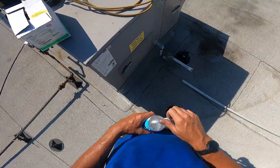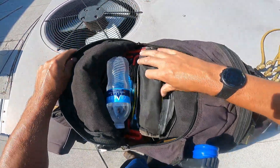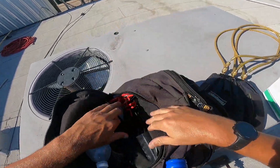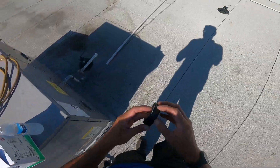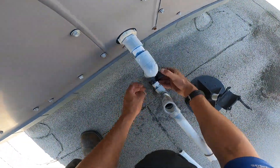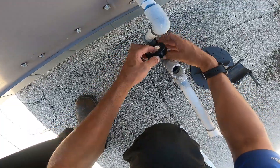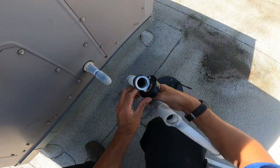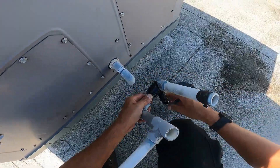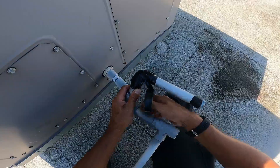The trap is leaking - that's super great. We're gonna do the right thing and tape the crap out of it, because I don't really have enough stuff to build another trap right now. I've got some one inch traps in the truck - don't ask why - but they ain't gonna work on this because this is three quarter inch. Let me tape up our leakage. I can see where it's cracked - it probably cracked in the wintertime during a freeze. That happens a lot with copper fittings. This is not copper, but PVC still cracks.